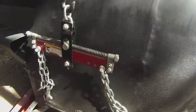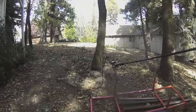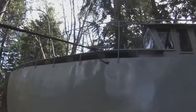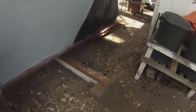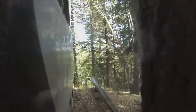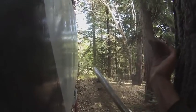I have this lift set up to put the pressure on two points just to spread out the weight. This rope from that tree is attached to a cleat so that if the boat were to rotate that way, it'll be caught by this rope. I'm not expecting any rotation, but why not plan for the worst. Same thing over here — that rope will catch it from that tree if the boat were to rotate the other way.